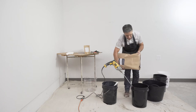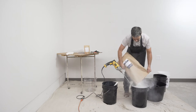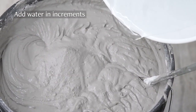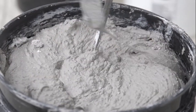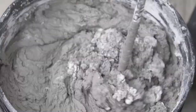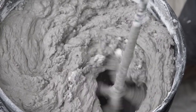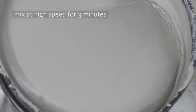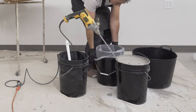Add about one-third of the plaster at a time. Mix well and scrape any dry plaster off the sides and into the mix. Keep adding plaster until the bag is empty. If needed, add small amounts of water as you go to get the right consistency. Clean any unmixed plaster from the side of the bucket. Once all of the plaster is in and you have the desired consistency, mix at high speed for three full minutes. Because there is no grit in marble and it is such a fine finish, straining removes any unmixed lumps that may occur. Marble is the only finish that needs to be strained in this way.